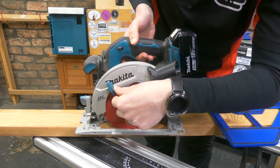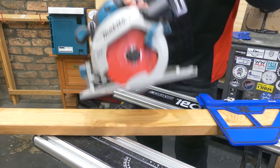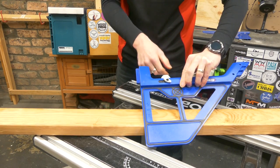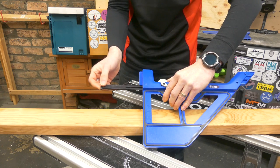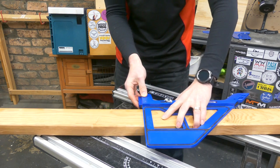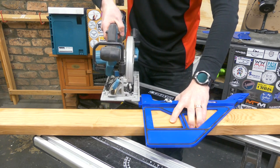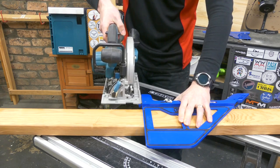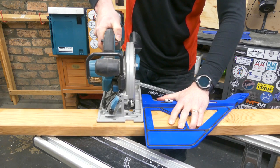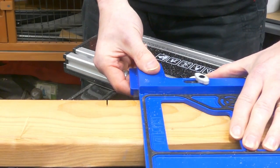You don't need a lot of saw showing here — just make sure you've got a nice shallow cut set. The important thing during your setup is that the jig doesn't move. It comes out of the box — you can undo those, which will make them slideable — and make sure they are tucked all the way in to begin with. Pick a spot on your 2x4, position the jig, get a good grip on it, safety gear on. One of the other new features of the portable crosscut are these little shelves to help you start and rest the saw on, and they are quite nice.